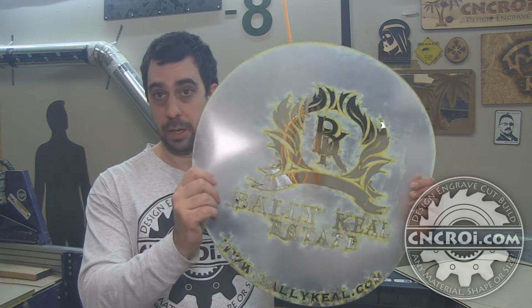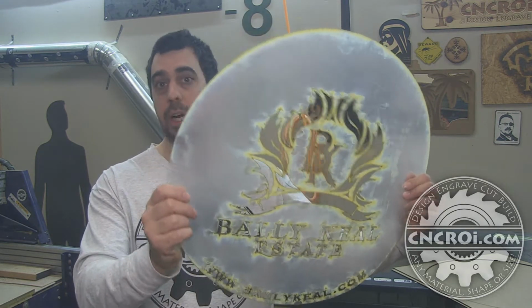Now again, the next material we use for a lot of custom stencils is actually stainless steel. The reason why you go with stainless steel over polycarbonate more often than not is because they're using a propane torch. Now if you're using fire on this stuff, it burns right up. But if you're using stainless steel, it's not affected by the flame whatsoever, no matter how hot of a flame you've got, unless you end up going with plasma, and then it's a whole other ballgame.